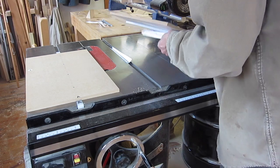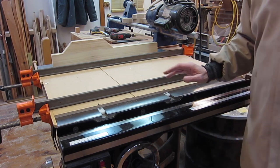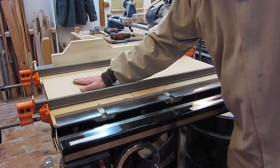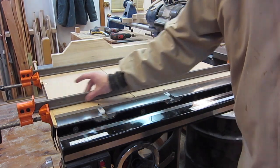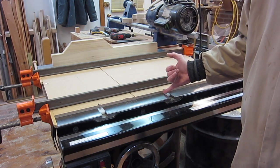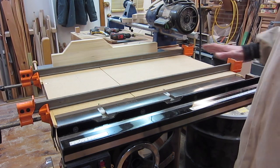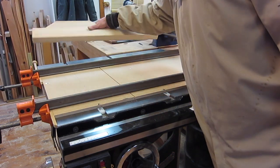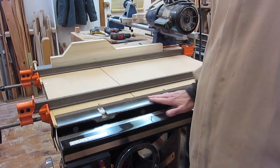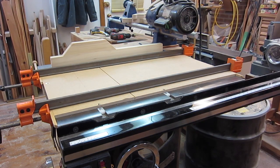I can remove the papers and make sure the inside edges are clean. Here's a great trick by Alan Turner, from Fine Woodworking July/August 2012: with these two pieces not connected, you can gently clamp them together, and that pushes the runners up snug against the inside edges. That's why I put the smooth edge of the runner against that edge. Now with confidence I can put on the fences, knowing that the whole jig will be stable in the table.